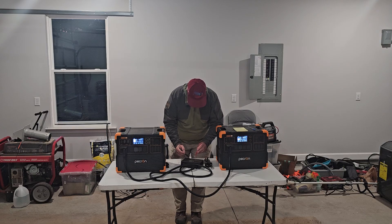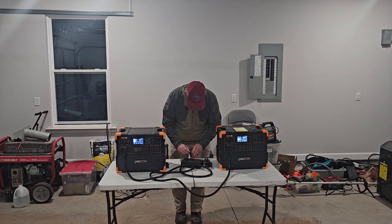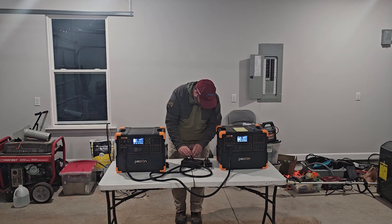This is line one, line two, and we're going to go across here and let's see what we have. I have 145. Now voltage is drifting — 141, 142, 140. I'm not sure that I have a good connection. The voltage is drifting around here.